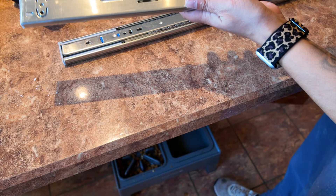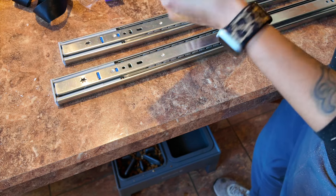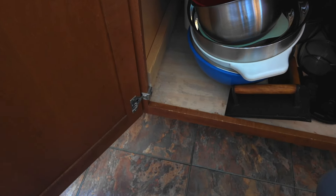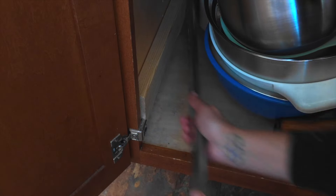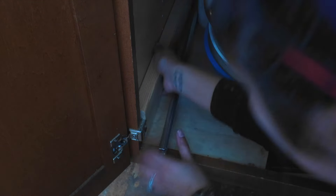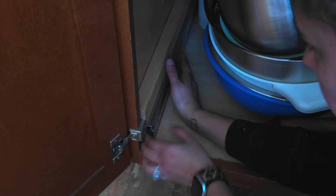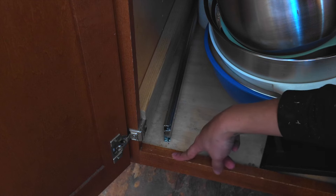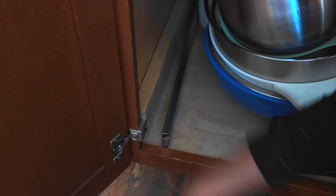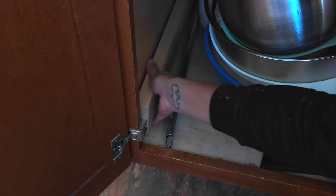This piece is for the drawer slide and this is for the wall. Maybe I do need the instructions just to make sure. So now what I need is, because I have the spacer in there, I need to take this piece and put it next to this and make sure that when I slide it out it clears. I'm not going to have it all the way lower because it has to be above the hinge. So I'm going to put it above the hinge and account for that one-eighth to one-fourth inch lip right here. Spacers are good, so I'm going to go ahead and drill these into my spacers.